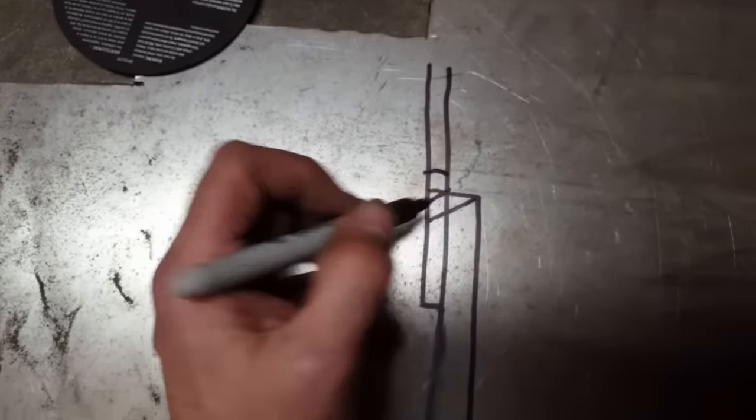There it is, all butt welded in place. Everything has been let go. You can look here and here. Everything is all even around the bottom. May have to dolly a bit on the bottom, but then get behind the panel a bit.